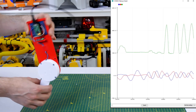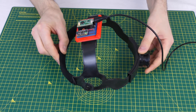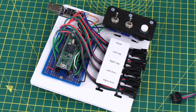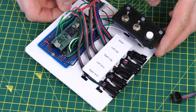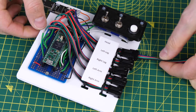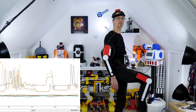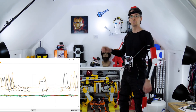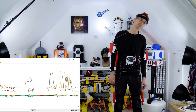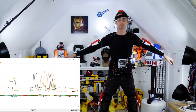The data is sent over serial and I'm using the Arduino serial plotter to visualize it. I also need to record my head motions, so I've got the IMU — the same as the others but without the joint encoder — attached to a headset. All of that data gets sent to the Teensy 4.1, mounted on a Core Components perma-proto board, with connectors for all four limbs and the head. That makes a rudimentary motion capture suit recording motions from my four limbs, joints, and head position. At the moment I'm just outputting it to the serial terminal for debug.